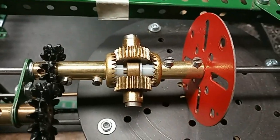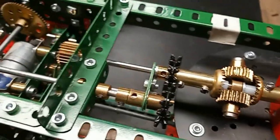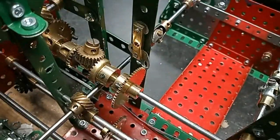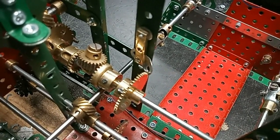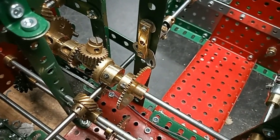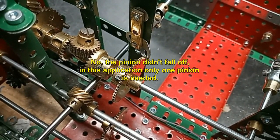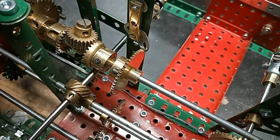The cage of the differential is fixed to the axle, and the wheel and the motor drive that axle through the differential. This differential is used for other configurations of the machine. At the moment it's just being used as a divide-by-two — it halves the speed of the drive, as the gear on the right, if you can see, is held in place simply by an obtuse angle bracket jammed into the teeth there to stop it moving.